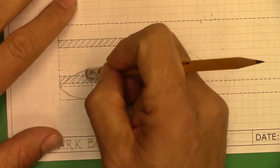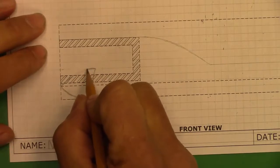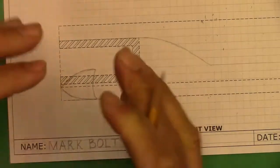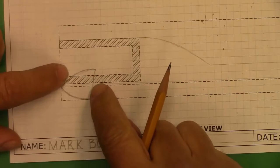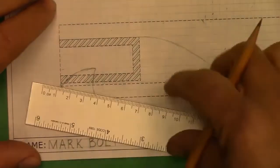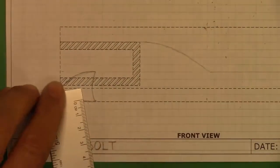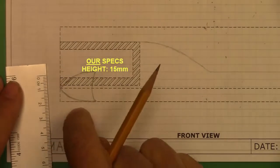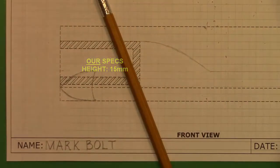You'll probably remember that whenever we cut wood, we never cut on the line. We always cut just outside this line. So we're not going to cut this exactly 25 by 20. We're going to end up cutting it a little bit bigger and sanding down to the outline of your pattern. So keep in mind, we're always going to cut things slightly larger to begin with. So this is legal. If I were to measure this, overall length is at least 25, and overall height is at least 20. That's legal. Okay? Any questions?